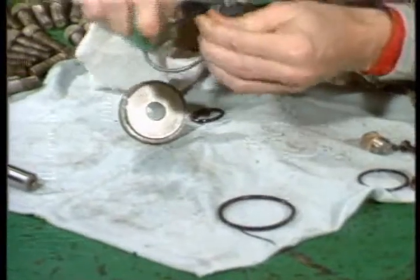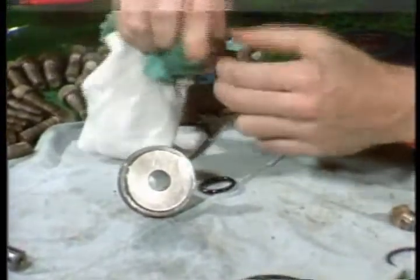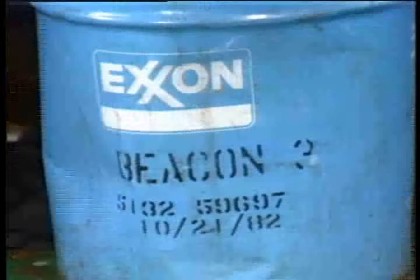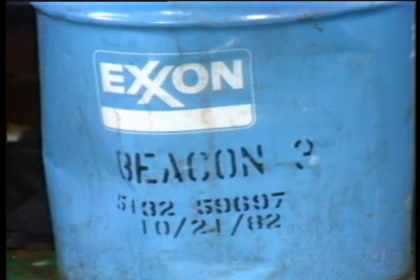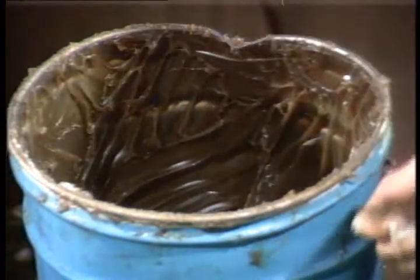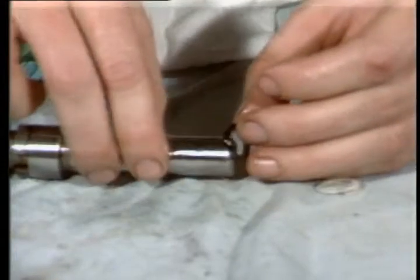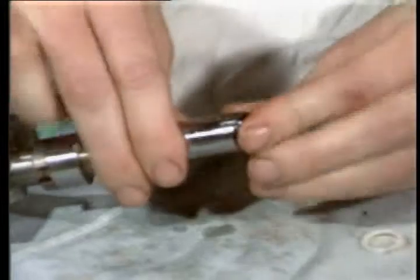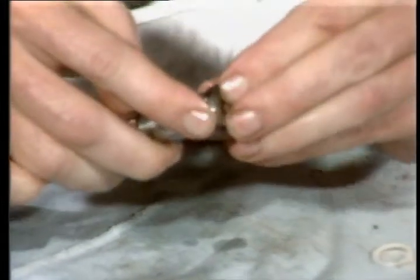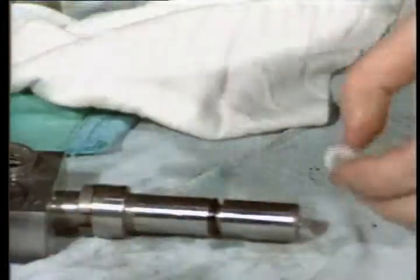The most important caution, don't over-lubricate. A simple light coat will do for each seal. And if you use a grease as a lubricant, understand that over-lubrication and grease will trap dirt and debris that may get into your BOP fluid. Soon it'll collect and severely damage the valve. This is especially critical in working seals. Seals that move in relation to metal parts. If they collect debris, they'll rub it across metal like sandpaper.